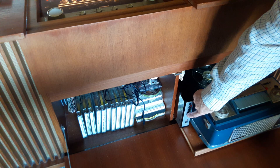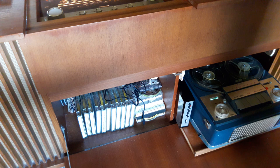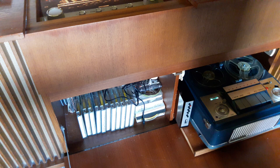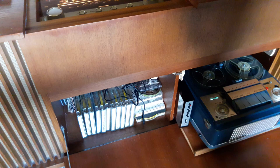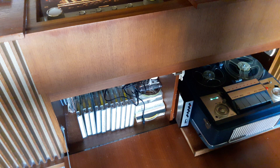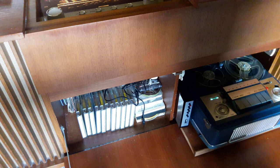I've now connected it to this tape recorder via the auxiliary socket. You've got several options on here that deal with the slide projector. At the back there's a DIN socket for stereo out, and you press a button for the 3¾ inches emphasis. Hopefully when I press this, the amplifier in the tape recorder does the left-hand channel, and the transistor amplifier in the little adapter will do the right-hand channel. You have a gain control — the volume control down here — and you basically try to get them equal, then use the stereo balance on the radiogram to even out any inconsistencies in channel balance.